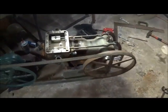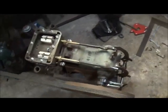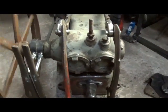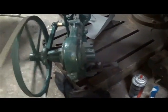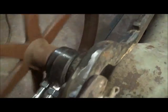I've got it sitting here turning off my other engine by belt. You can see I've just got it turning real slow — I don't want it to turn fast. You can get an idea how this valve train works. Got it all hooked up now. I haven't cut these off and shortened them up yet, and I may not. You can see they look twisted — that's because when it was forged, it was forged that way. I'm not running the pulley or flywheel I'm going to use, this is just a temporary flywheel. You can see my eccentric's working, and I don't have it in time yet — I figured I'd break it in here a little bit. See the lever's moving.